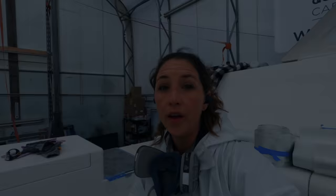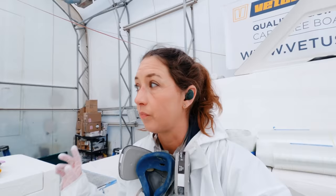All right, well, since I seem to be the fairing queen of the boat, in addition to fairing smooth all of the surfaces that aren't going to have veneers or linings, another one of my jobs recently is to fill the edges of surfaces to make sure that when we do finish them, they'll be nice, like our water tanks. So before we can glass in the next upper section, he had to cut out the holes for what would be our inspection ports, which we just got in from Vetus.